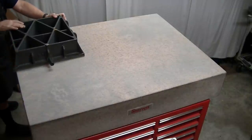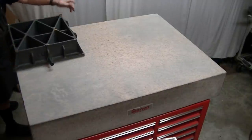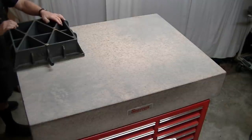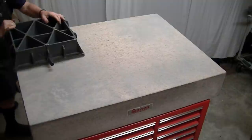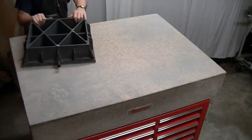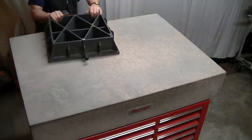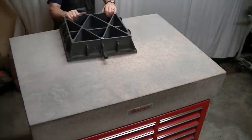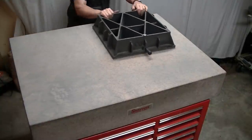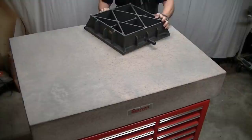These opposite corners that are technically low relative to those are still high in overall concavity. I just need to focus more on the two opposite corners there. I'm trying to stay away from the middle, but not overhang too much, because if you roll the edge over, you'll be a real unhappy camper.